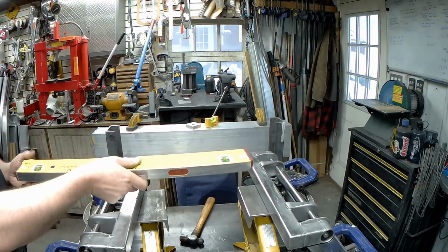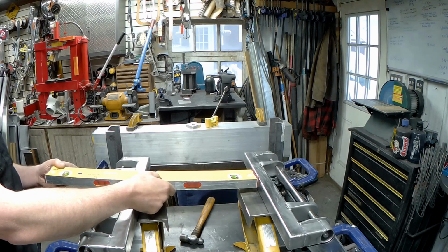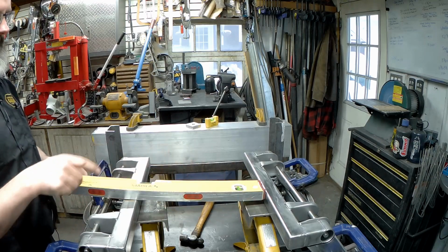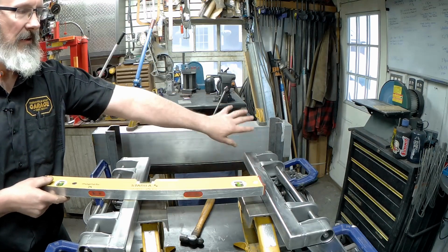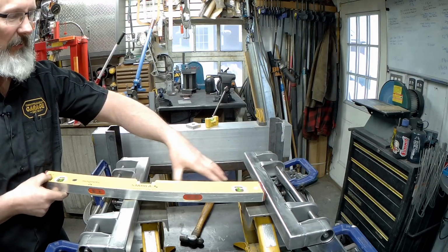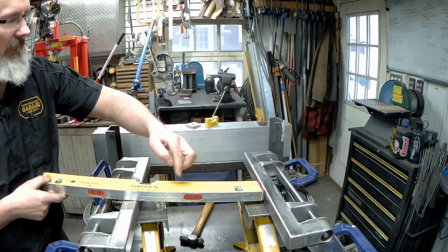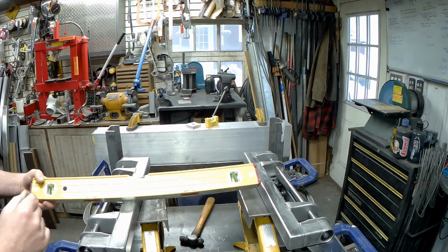Now again, I've got to put a cross member between here. Actually, it'll sit somewhere biased slightly towards the front, but not as far as you think. Because remember, the lower control arm bolts to here. There's nothing forward of here, just engines and other things that I'm sure are going to get in the way, but I gotta put my steering bracket in here. We're going the other way, so it's actually back quite a ways. And I will be putting some cross bracing in to help things out a little bit here, but that's really all it's going to need.